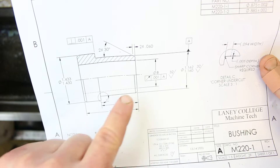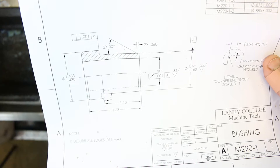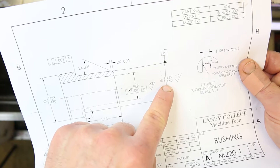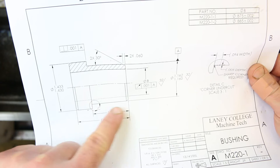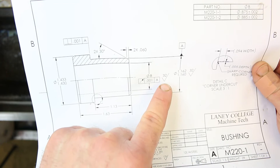We're going to start with the bore, then machine the outside diameter that becomes datum feature A, and then machine the outside diameter on the shoulder. There are a number of things to watch out for beyond GD&T controls — lengths to maintain, very tight size dimensions. Two thousandths of an inch is the tightest we've got, plus or minus two thousandths gives four thousandths total, and over here we've got a total of three thousandths. We also have to worry about surface finishes on two diameters: the outside diameter that becomes datum feature A and the inside diameter B given in the table.